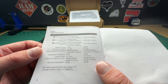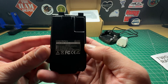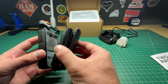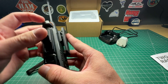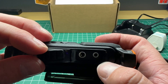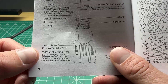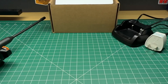The output power is about five watts. It comes with a lithium-ion 1600 milliamp hour, 7.2 volt battery. I've put the belt clip on the back — it's quite a substantial, decent battery. One of the first things I noticed was it has USB-C for charging, which is really handy. There is also a speaker mic port, a PTT and a couple of function buttons on the side, a light on top, and a volume knob that also turns the radio on and off. The microphone jacks appear to be used for programming, so you can likely program this using Chirp or another piece of software.